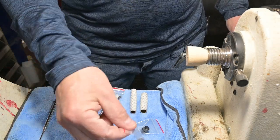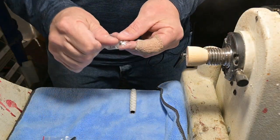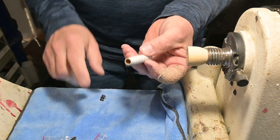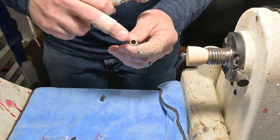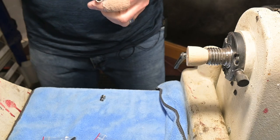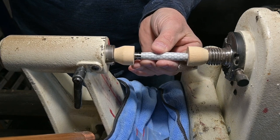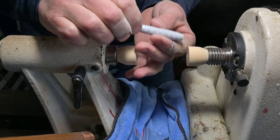I'm going to put this part together first — I need the male coupler and this tip. We'll do the coupler first. One other thing I almost forgot — get some kind of chamfer tool, get in there and bevel the edge of your tube. It's brass, it'll bevel out and make it go together much easier. Doesn't take a lot. So we're going to put this in on this end, slide that on, slide this over, get it close, lock it down, and press it together until they touch. There we go — that's pressed, that's together.